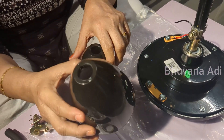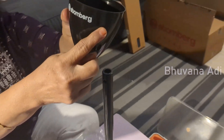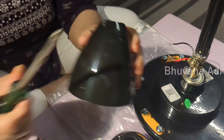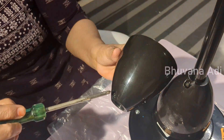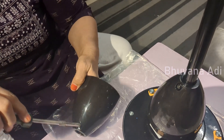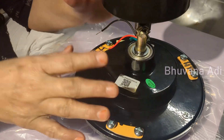These are the two caps or cups of the canopies — the bottom and the top. The top will go with the brand name visible. So first I will fit the bottom one, for which I will have to loosen the screw first. Similarly, I will loosen the screw on the top canopy and temporarily tighten it somewhere in the middle of the rod, so that I can finish connecting the wire.